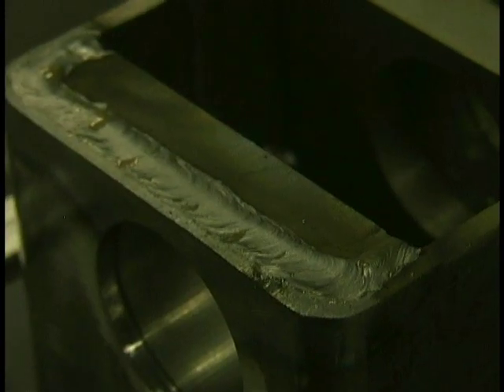Once I got it clamped up, I'm running this pretty hot — short circuit MIG, on the high end of the range. I think probably 20-21 volts, 280 to 300 inches per minute of 0.035 wire, 75/25 argon-CO2 gas. I'm trying to stay on the front of the puddle but back up into it occasionally to build up, because this is going to be machined off. If it gets machined off and there are low places, that's bad — you have to rework it, and rework is bad when you're trying to make a little money.